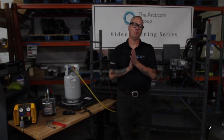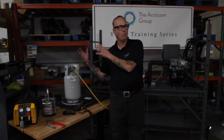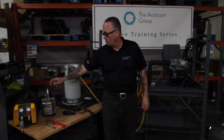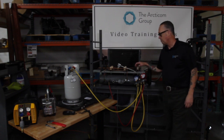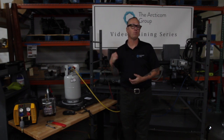That's it for our recovery video. Let me do a quick recap of all the tools we had available. We're not endorsing any brands — these are just tools that we use. You may not have this same exact recovery machine on your van, so please read your manuals and understand all the features before you get started. We have a recovery machine, a vacuum pump — generally a 3 CFM is all you're going to need, 3 to 5 and you'll be just fine — an adjustable wrench, service wrench, digital scale, 30-pound recovery tank, and a manifold set. These are all the tools you need to properly recover refrigerant out of a self-contained system.